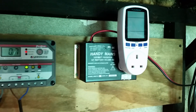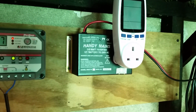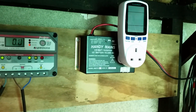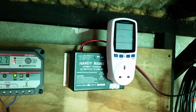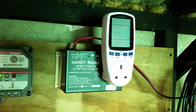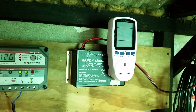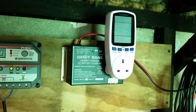Then there's the handy mains inverter, which gets too hot — that's why I've switched over to the DeWalt charger, because it's 12 volt and that way I don't have to use the inverter. I used a meter, put the plug into that, and I didn't draw over the recommended 200 watts, which the inverter says it can put out — in fact it was well below that.